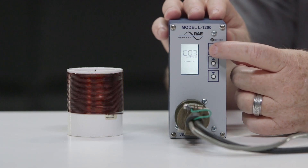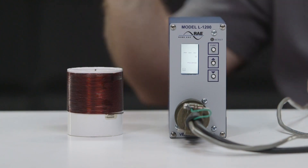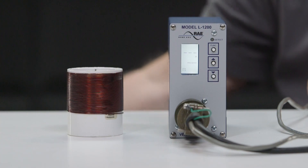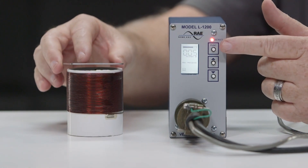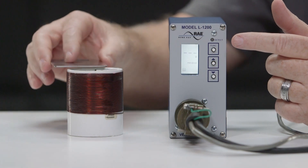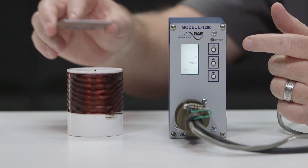Let's put a 3-second extension on the unit. Push the function buttons on the front panel for 2 seconds to reset the unit. Once the car leaves the loop, the extension period begins. The detect LED flashes at a 16 Hz rate and the LCD displays a countdown of the call extension time. When a vehicle leaves the detection zone, the output remains active until the extension time reaches 0. The factory default setting of call extension time is 0 seconds.